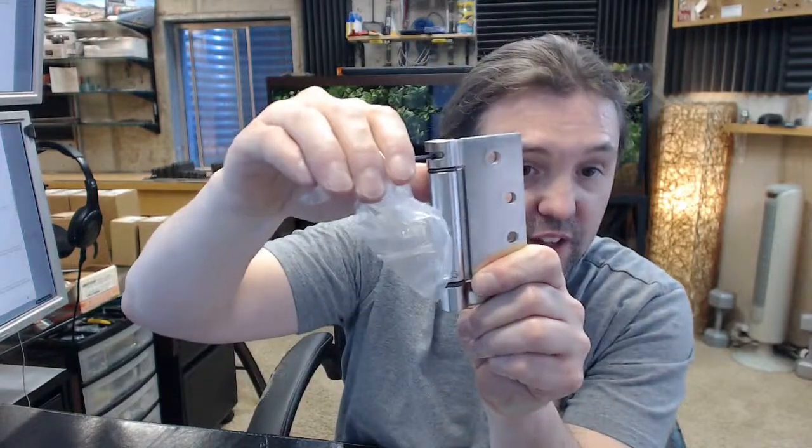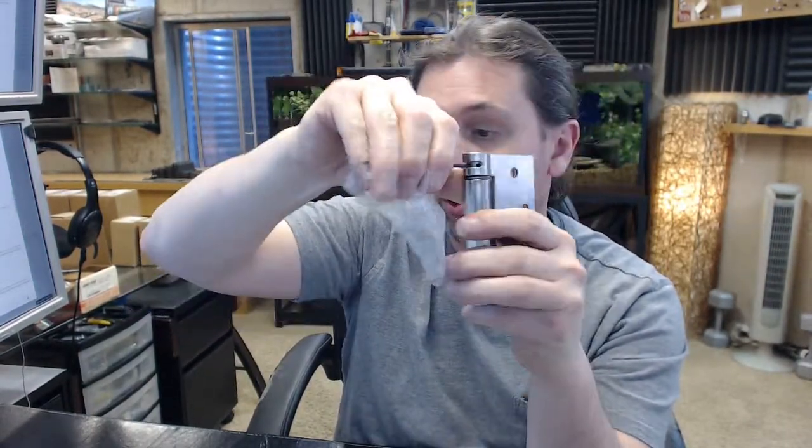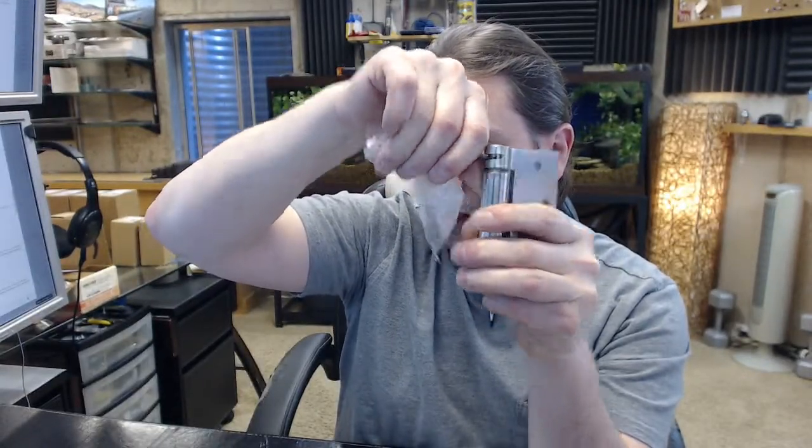When the tension collar is pointed towards the top of the door, you insert the pin into one of the holes and then turn it clockwise. It's into one of those new holes that you reveal that you insert the tension pin. Up to 3 holes maximum, I think, is what they recommend for these. I don't see that it's specifically listed, but 3 holes is a common quantity to reveal. If you hear any creaking, it's that spring contorting inside of there. You don't want that. You'll have to back it off.